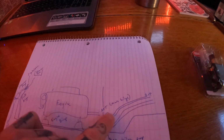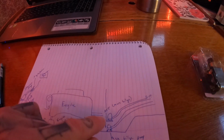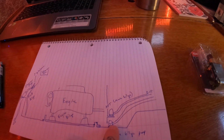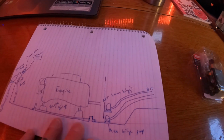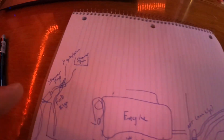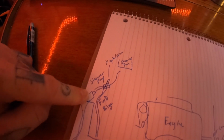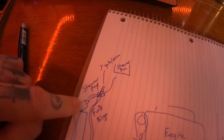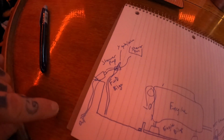There's also that little diaphragm pump, which is mounted just above on here, and that can be turned on manually just to empty the last inch of water to prevent this pump from cycling all the time. Now, in case of an even bigger emergency where we need more pumping capacity, I have a shower diaphragm pump that I can turn on via a switch in the shower, and that normally just pumps water from the shower pan to the outside of the boat.